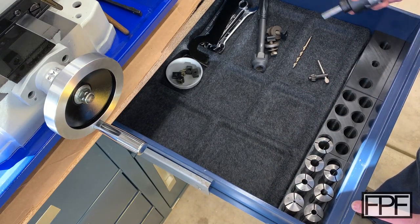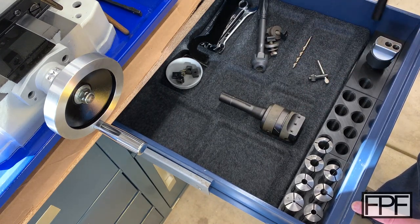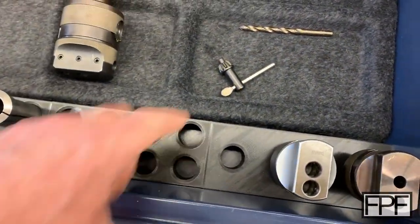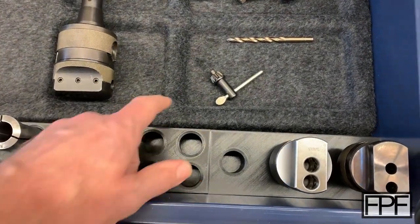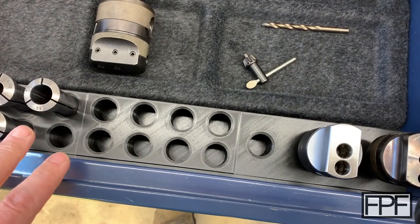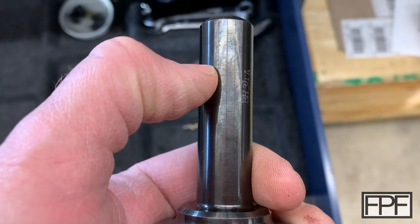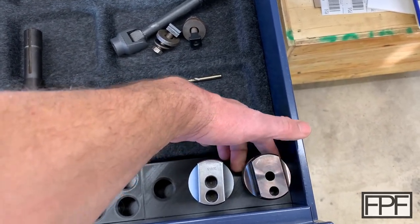Let's see if the boring bars fit in too. That's perfect. This big one's not going to fit, but the smaller one should. That's a little snug, but it still does drop right in. Being a modular design, it's actually a really snug fit left to right, which is probably good — if there was play in here these guys might rotate out of place a bit since this is fabric and doesn't seat up real hard against it. Being such a tight fit, I don't think this is going anywhere. You can actually hear the layers of the 3D print meshing with the lathe marks on the shaft of this guy, but it does slip in. It's plenty heavy enough that I can just line it up, drop it, and it goes right in.